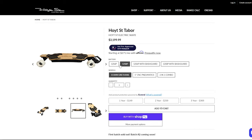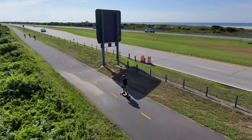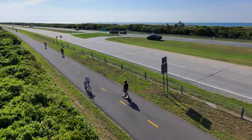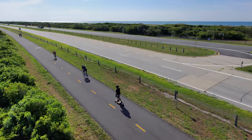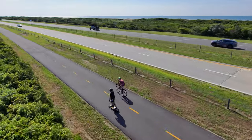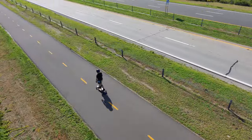The Tabor has different battery options, but personally I only consider the largest one to be worth considering. I understand the desire to hit certain price points, but since the 12S8P and 12S6P are housed in the same enclosure, going for fewer cells feels like I'd just be leaving internal real estate on the table. That being said, this review loaner has the 12S8P configuration using the Molicel P42A. What matters here is not just the labels attached to the marketing copy, but the reality of the battery itself. Their packs are made in-house and designed and constructed in a way that the build of the pack will outlast the cells themselves. With in-house construction and quality control, things like sloppy welds, cold solder joints, and construction slop are simply not there. It's made to last and it's made to survive. More details and photos of the internals can be found in the link below.